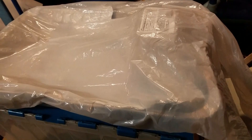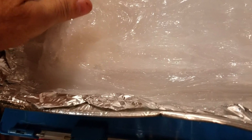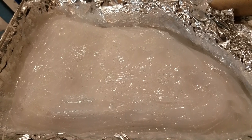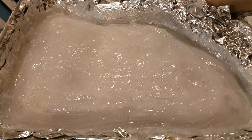Here we are on day two. Overnight I put the mold into a bag to keep the smell down and in a box in my spare bedroom where it's warm. I brought it back down to the garage to open because it still stinks to high heaven. The silicone has settled quite a bit and it's fairly flat across the top, but it's still pretty mushy inside, so it's going to need to cure a bit longer before I can separate the cast from the mold. I'll give it another day of warm air — it goes back in the bag and back to a warm place.